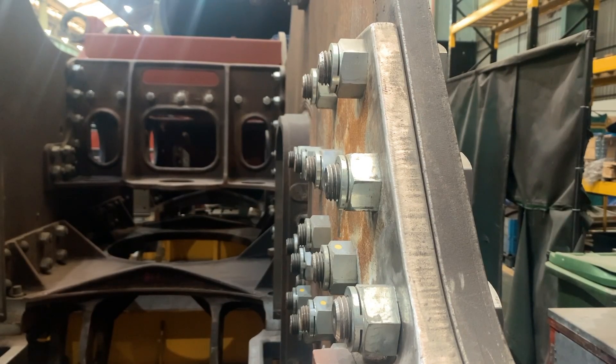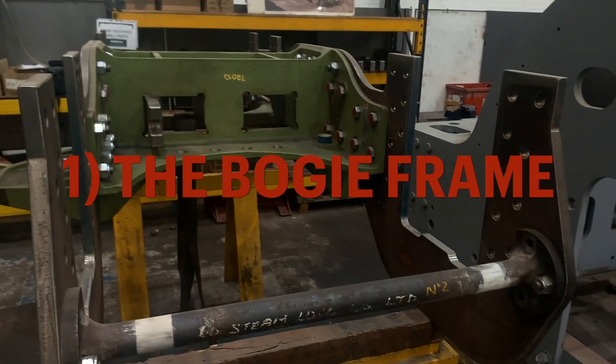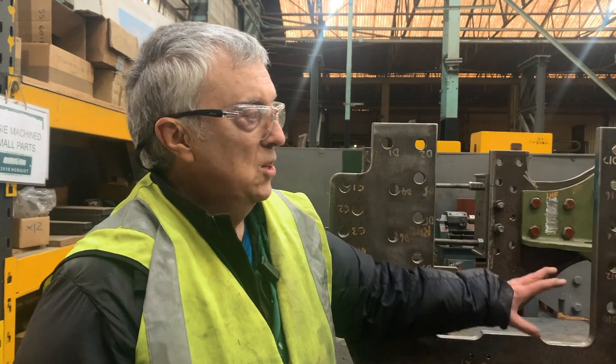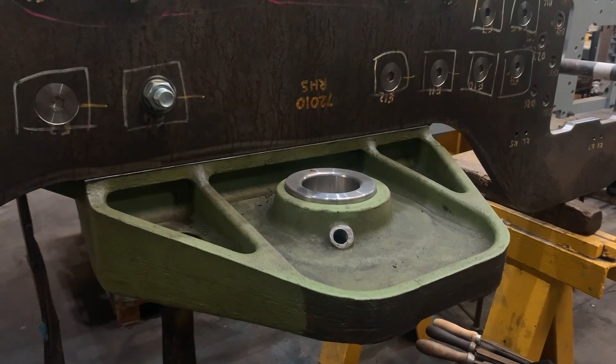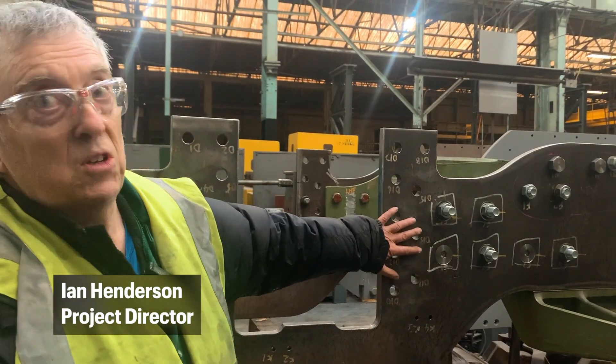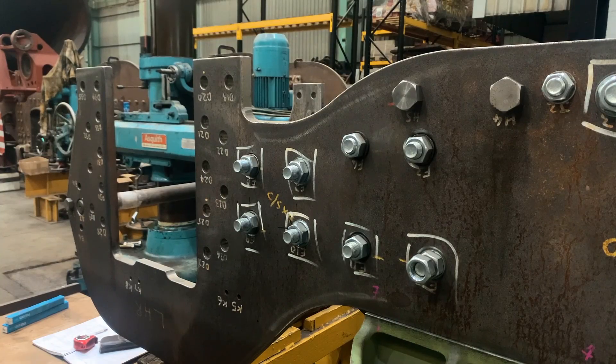All the time new metalwork is appearing. This is basically the bogie that sits at the front of the locomotive - it's a four-wheel truck. It consists of three main parts: the central cast stretcher which is sitting here, and these plate frames which are bolted very firmly to the sides using fitted bolts. They've got to be very tight fitted bolts on there.